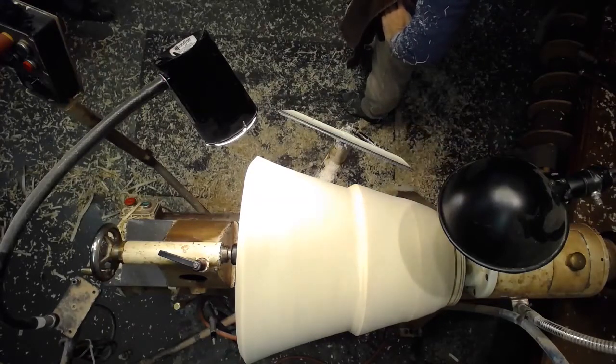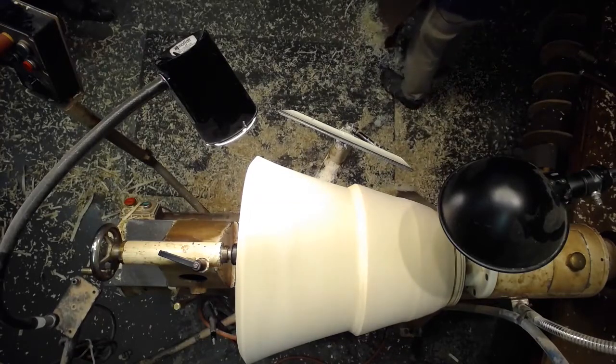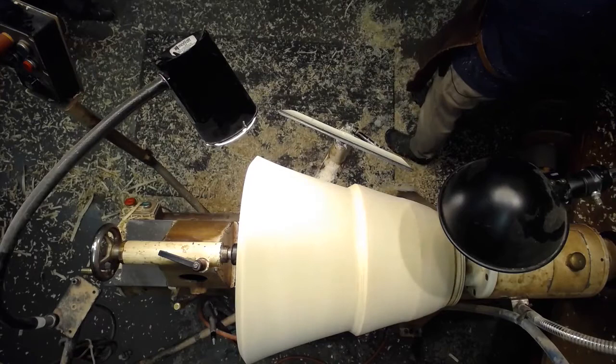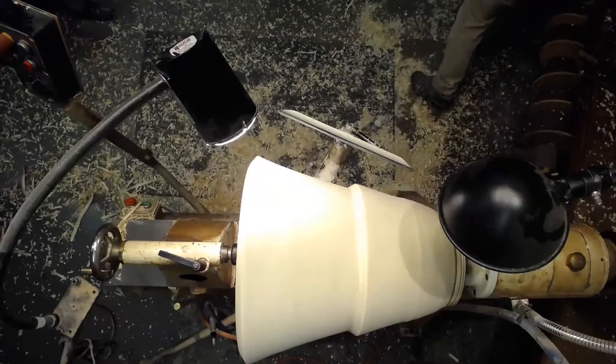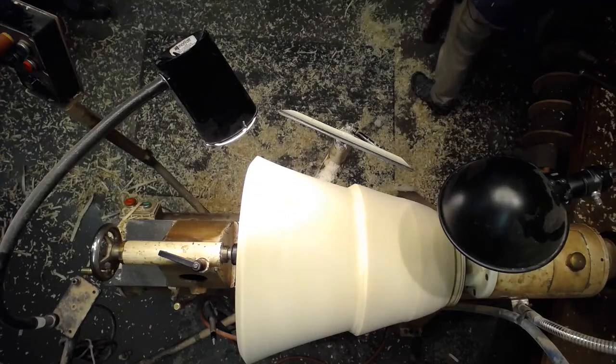Probably if you felt like you had really good control over it, a flat scraper, one that was rectangular, would mean you're tipping it up on its edge, and if it's catching near the upper end of the scraper, it's going to have a tendency to vibrate on you, trying to tip over. Whereas the round stock here and the control of the arm brace allows you to have so much control that it doesn't feel like it's tipping, tweaking around.